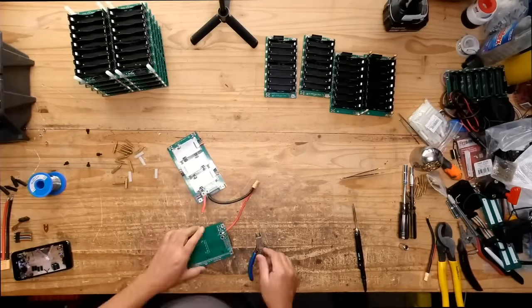So this external battery is working. And it's at 47 volts, so we'll have to do the math there to see how far it is. But 567 watt hours have come from this battery right here. And it's at 9 amps, so it's removing almost 10 amps from this battery. The meter here is showing 1%. I don't know how it's calculating the 1%, and that it's got 1 minute left, but I think it's going to be there for a while.